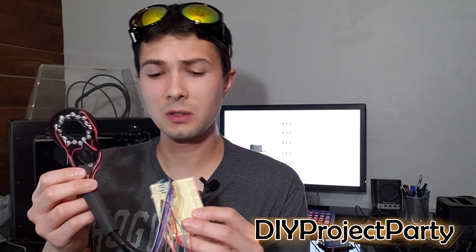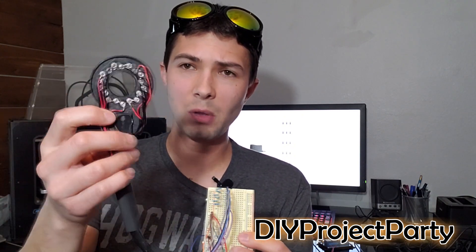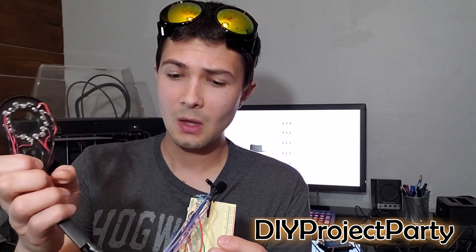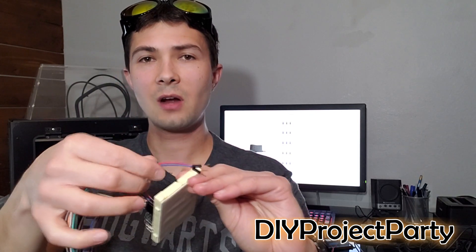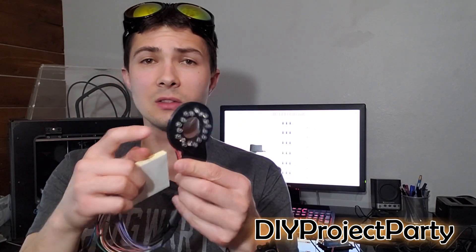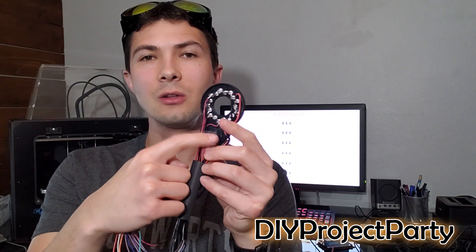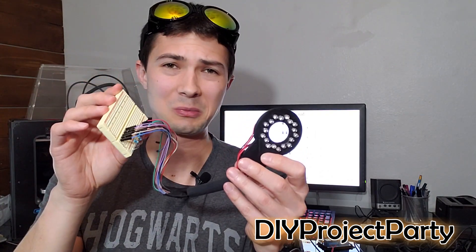One of the things that I did was breadboard this solution. I have my breadboard here along with my 47 ohm resistors, and I wired all of these black and red wires to the six groups of three LEDs. They all run down this heat shrink tubing here, joined up at the top and then into the breadboard, and then I have a couple of pigtails that I plug into my power source. After I got all this wired up, I popped all of these IR LEDs into my 3D printed ring, and then refer back to the original video for how I put an IR filter made out of old exposed film negatives here. Then I hot glued this onto a webcam, and this all hid behind a box that looked very Harry Potter-ish to hide all of the wiring mess.